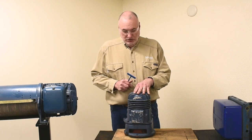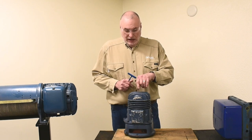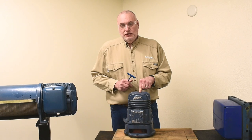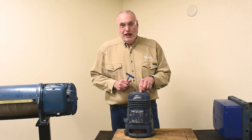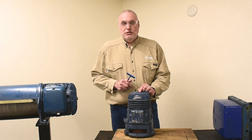The back of the cap has a hole where you can see the end of the microspeed motor shaft. When this motor is energized, by looking in that hole — some have a cap to remove to view — you can see the displacement at the end of the shaft. Simply take a depth measurement running and not energized with the brake set, and compare the distance to measure your axial displacement.